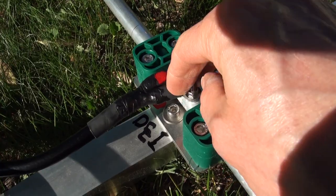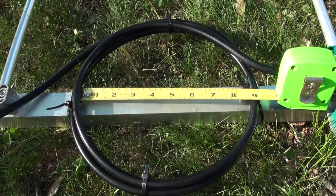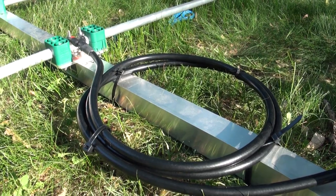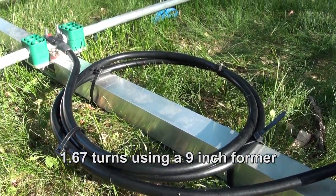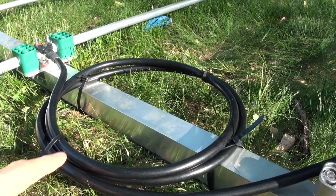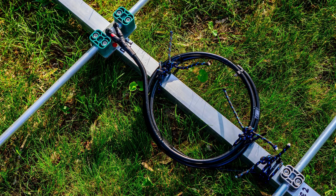Next I'm going to put some liquid tape over this. For the feed line choke, I just went with an air-wound design with two turns of the HyperFlex 10, and I chose 9 inches in diameter. After watching a video presentation by W6NBC — excellent, link below — I followed his formula, which said somewhere around 1.67 turns, so two is actually more than I need. You can't hurt to have more turns, but if you do you'll need more than 10 feet of HyperFlex 10 — probably closer to 13 to 15 feet. To secure your choke, don't just use plastic cable ties — they will break, I guarantee it. I highly recommend Mastrant or something similar in addition to cable ties; it'll last a lot longer.